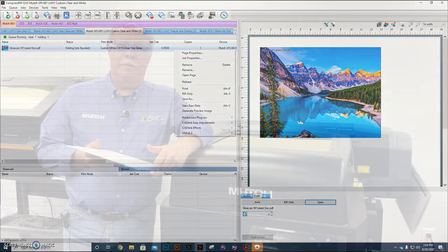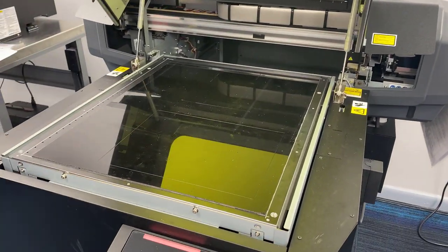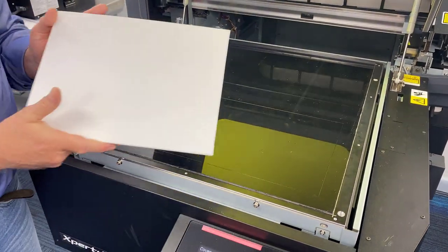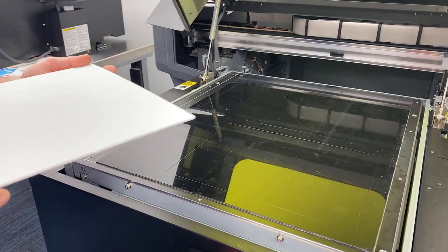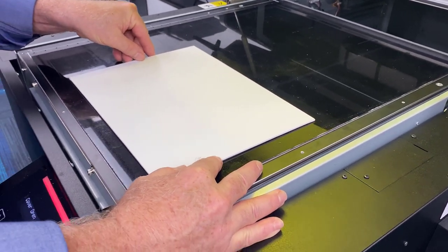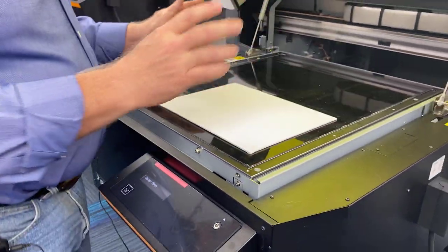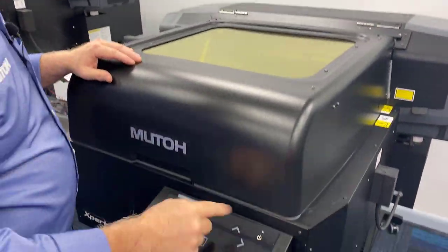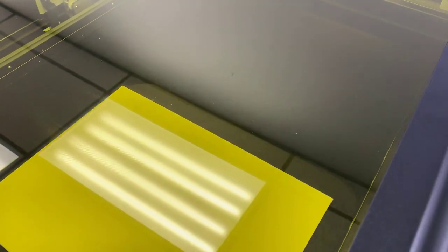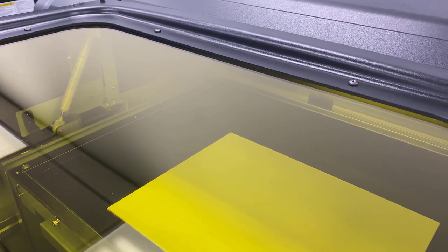We've sent over an outline to the bed that we're going to work from. It's black printed on black, but you can see it against the sun, and I've actually bled it just a hair over. This is a 12 by 9 canvas, and we printed it 12.1 by 9.1, so we're going to align this right inside of the outlines. Perfect — this way it'll bleed over fully. Got that in position, and we'll go ahead and close this up and hit set media. It's going to take it back and set the height just where we need it to be. As you can see, there's actually a little laser back here — it's hard to see through the yellow screen — it's found the material and it's dropping down. It's going to scan that material as it goes through and set our print height.